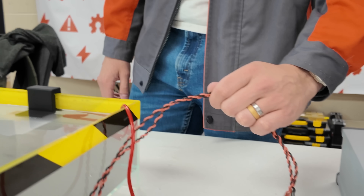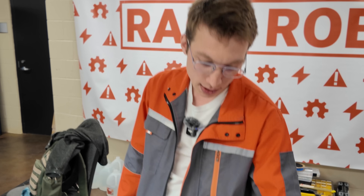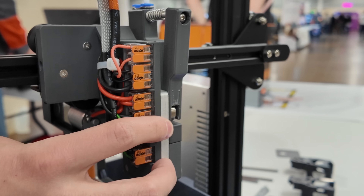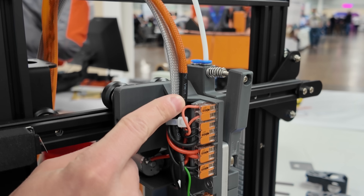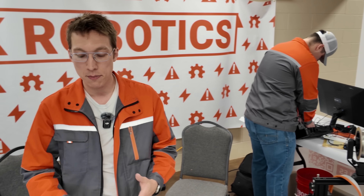If you're standing nearby while it's machining, you're not in any danger. Obviously if you have heart conditions or a pacemaker, talk to your doctor first. There are electrical fields generated — EMI is generated from the high voltage establishing and stopping current over and over, creating an electric field opening and closing a lot. That's why the power cables that come with this are twisted pairs. We have a grounded connection to the endoskeleton so it's not going to become an unintentional antenna, and the anode wires are twisted with the cathode wire to create the shortest untwisted path to where machining happens, minimizing EMI.